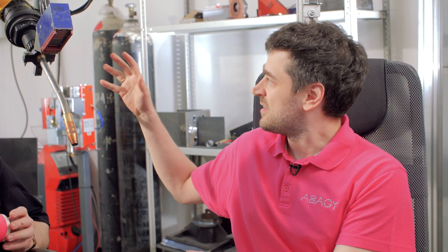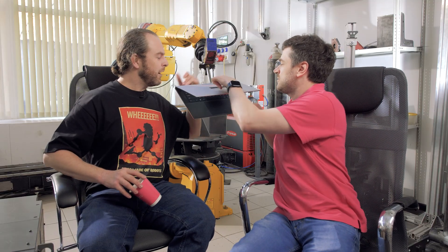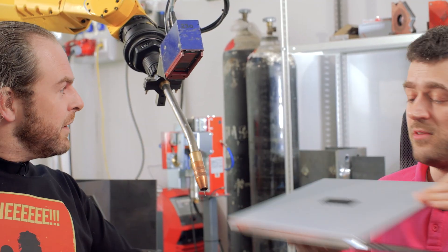Simple question: laser scanning — we do it in the shops when we scan our products. Is this similar? Well, in some sense. The laser scanner is actually the eyes of the robot. And there are two main parts in it: the laser projector — there's a red beam over there so you can see the line — and there is also a camera that captures the line.